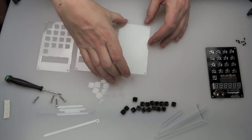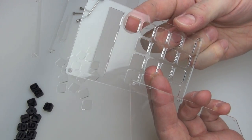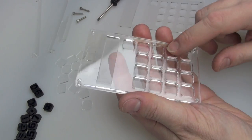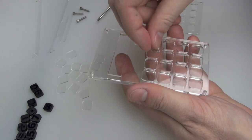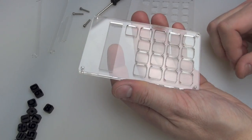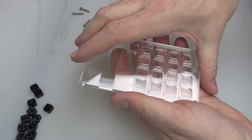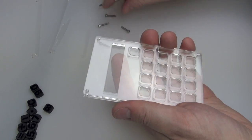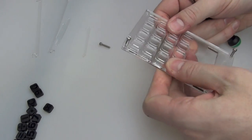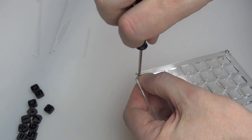Be pretty careful with the thinner bits of plastic covered with white sticky-back stuff — you can sometimes make a crack in that plastic, so really take your time; you don't want to damage anything after doing a good job with the soldering. We're peeling the numbers off the number keys now — just the white tape over the glossy black number, not the backs. Now we're ready to assemble. Start with the back plate — the solid piece — then the thicker piece goes over it with the sort of button at the top right. The next thing is to put the little tiny plastic squares we've peeled off into each space, then put the top layer on the right way around with the extra hole at the top right. Put the hex screws in temporarily to hold it all in place.